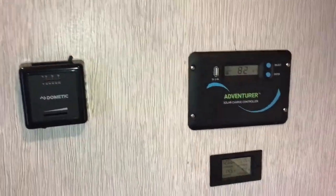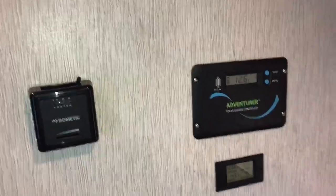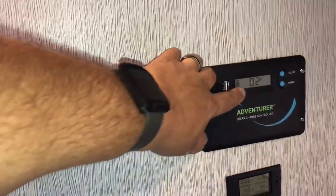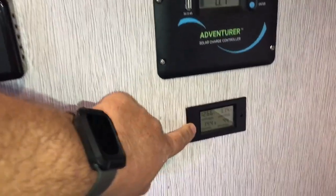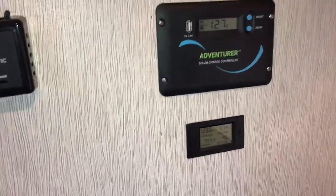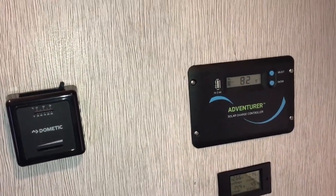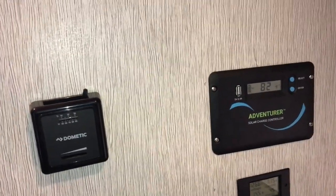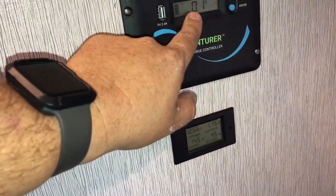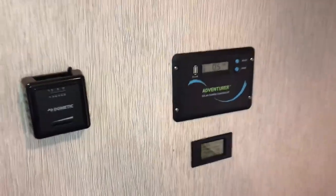Monitoring this during the daytime — my power converter is off right now and solar is just starting to supply power, the sun is just starting to come up. I'm only supplying about 0.2 amps, but it is showing the actual draw from the battery still. The overhead light draws about 1.1 to 1.2 amps, and there's also about 0.2 amps from the RV LP gas leak detector. The reason why that math doesn't add up is because the solar is actually feeding and supplying just a little bit of that power. So that's working out pretty nicely.